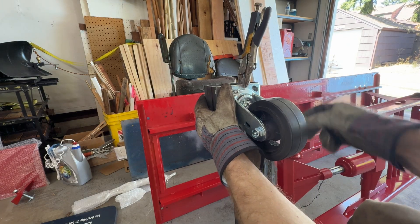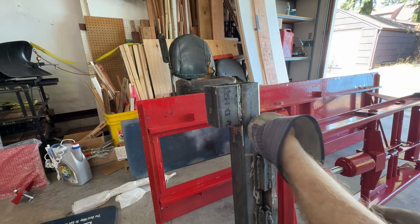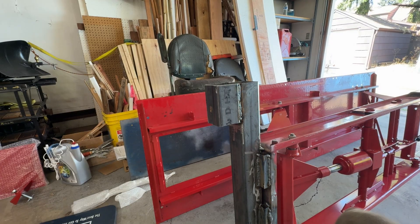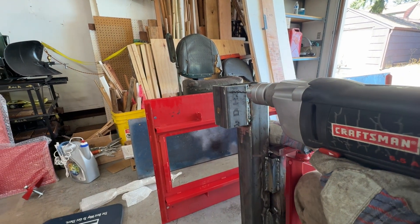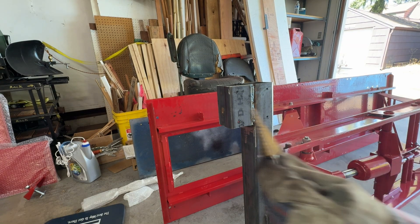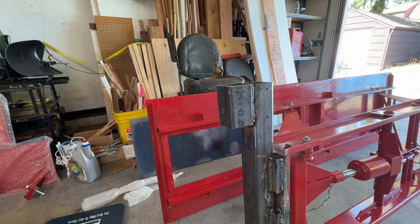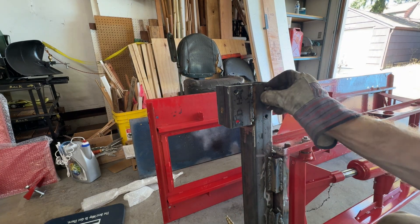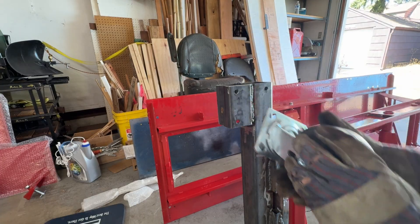That's sufficient if you're careful to get the drill bit started. Now we can remove the wheel — you can see we have little dimples. You can make a deeper dimple if you need to, but I found that's about all you need. I'm going to dip the drill in some lubricant and find that dimple. The step drill is nice because it has a lot of different sizes in one — you can see all the different steps, and this is the cutting edge. It has two cutting edges on this particular step drill. It gives you a nice finished hole. Let's put this up here to get an idea of what it will look like after I put the fastener in.